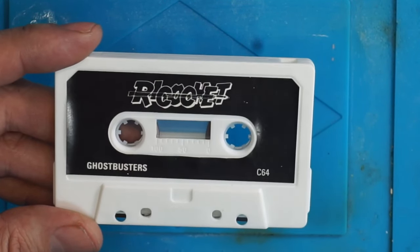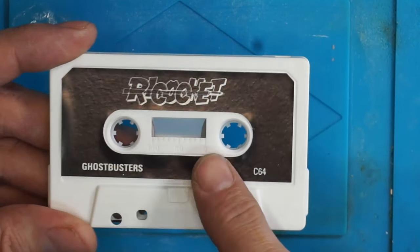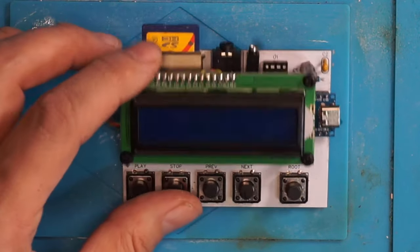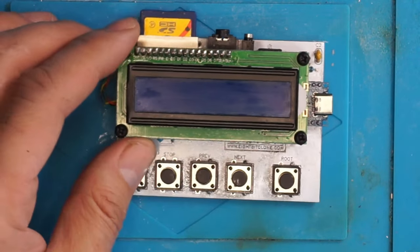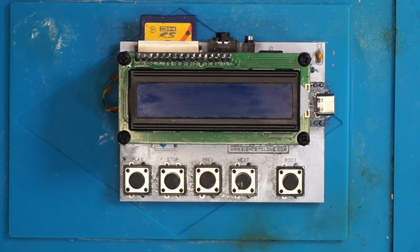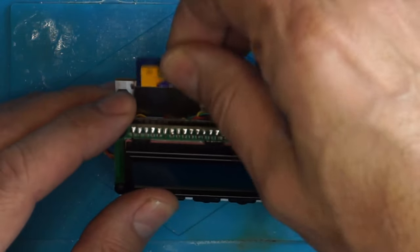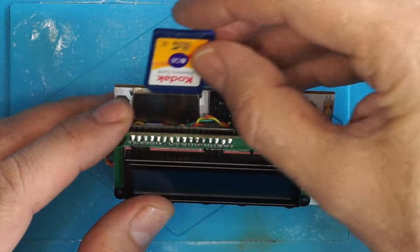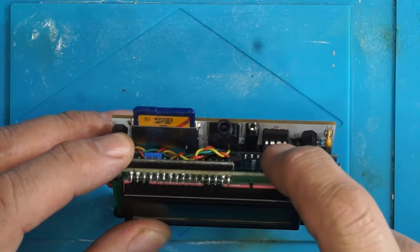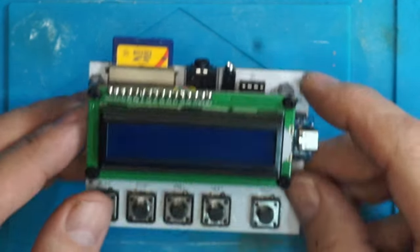So today, with today's technology, I'm sure we can improve on this. So today, we can build these TZXduinos. Now this is a replacement to your cassette drive. Obviously, it's a lot more reliable because it doesn't rely on tapes. Everything is on an SD card here at the back. It has its audio out and also a remote, and then its audio amplifier here, and it's powered off a USB-C here through the Arduino.